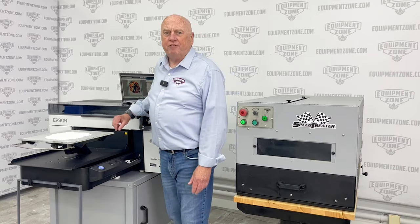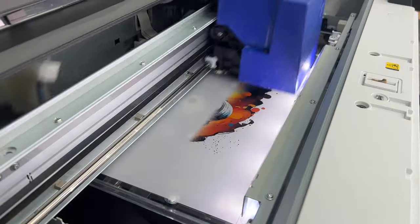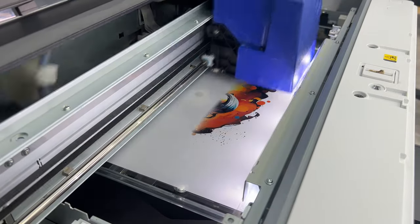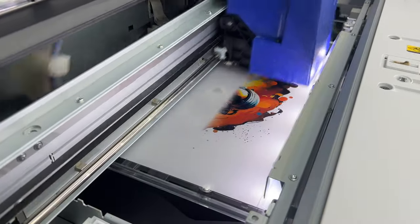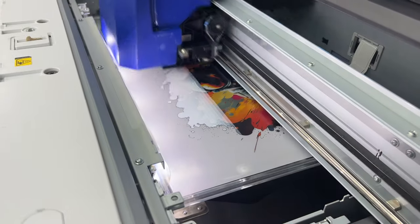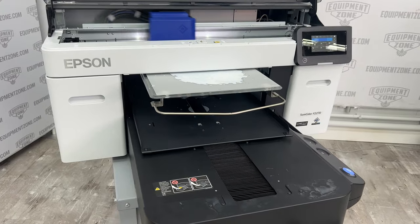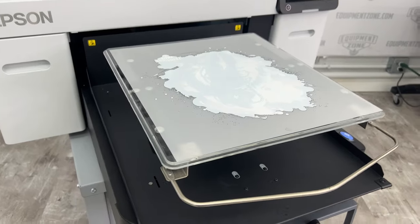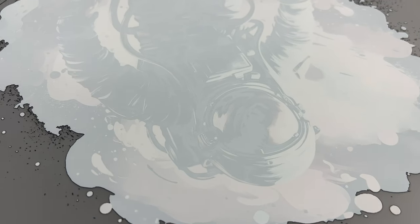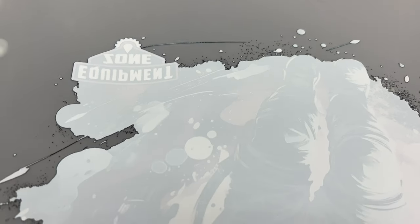One of the great features of the F2270 is that it's a dual printer — it also does DTF transfers. With DTG, your best substrate is 100% cotton or high cotton content blends, but with a DTF transfer you can apply to virtually any fabric. On 100% polyester it prints beautifully — cure it at 275 degrees and you won't get any discoloration of your garment. You'll have perfectly white ink on 100% polyester with no dye migration, which is great for screen printers.